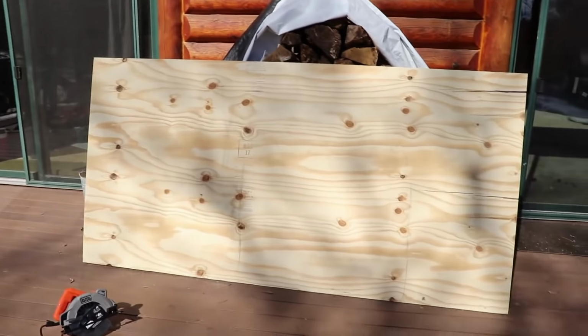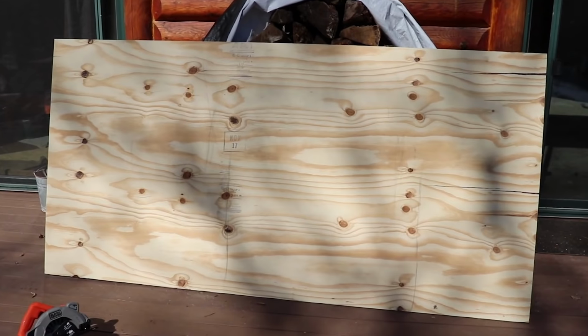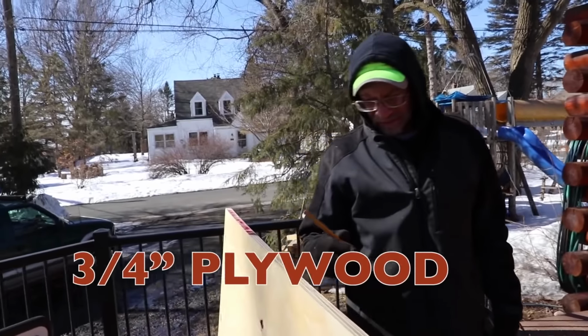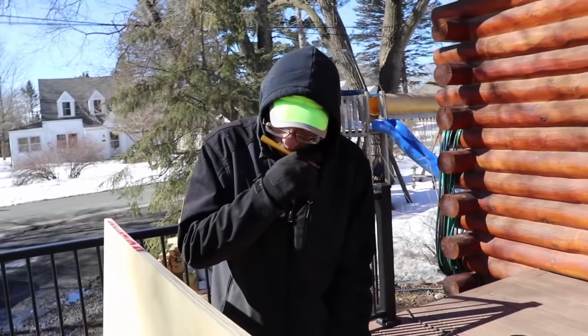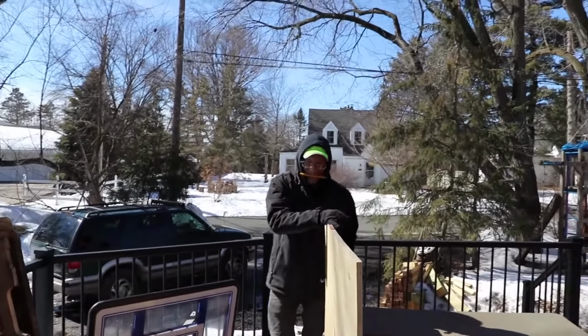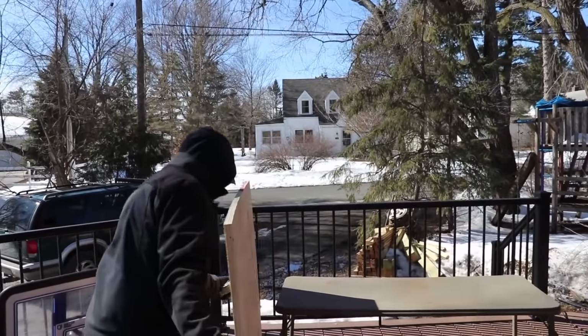So we're gonna be starting with 2 sheets of plywood. We're not even using 2 full sheets, are we, Frankie? No, I wanted to go with the very top piece with 3/4 inch, and the bottom of my sink will be 3/4 inch for the drain reasons and for the countertop reason. Okay, so the top we need the most strength in because that's gonna be the support for the structure. Yep. And it's got to span the gap, so that's why 3/4 plywood.